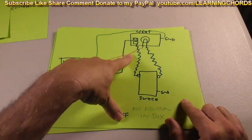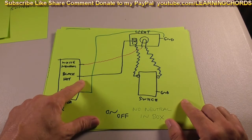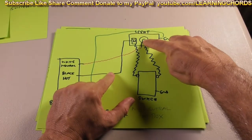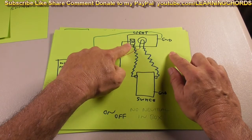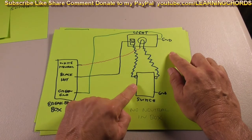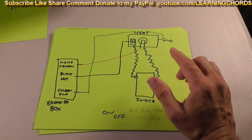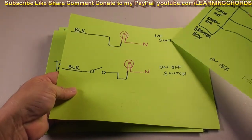And so what we see here is the neutral goes into the light, and the hot goes from the power, from the circuit breaker, wherever it's going to go, into the light with a wire nut. It's not connected to the light. The hot goes into the light box, goes to a wire nut, drops down to the switch. The switch box connects from the switch up to the light. And again, it's the same type of circuit we had here. You need power, you need neutral to light everything.